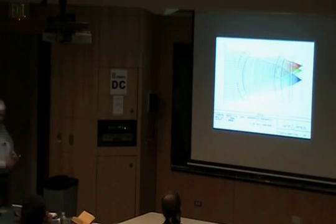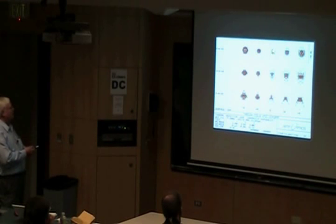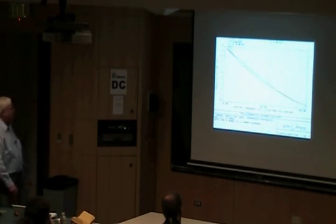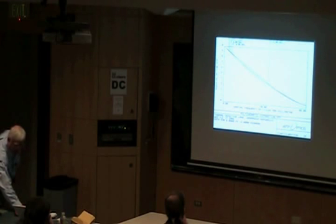You get a pretty good image. Pretty good being, these are the spot diagrams compared to a circle representing what they call the Airy disk, which is a good diffraction image. So they're not bad for two elements. That's the modulation transfer function, and these are for different angles. 15 degrees off axis is the lowest one. But that's the way you normally would judge a lens design.